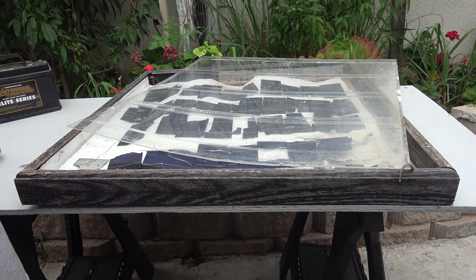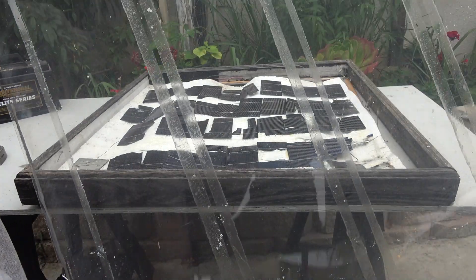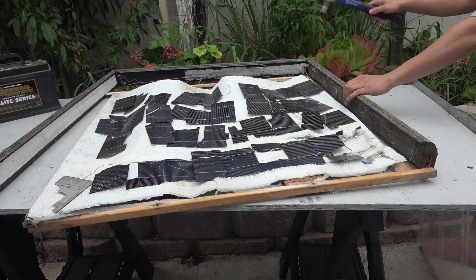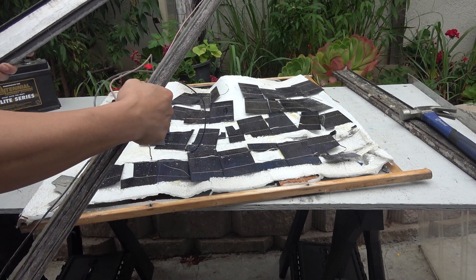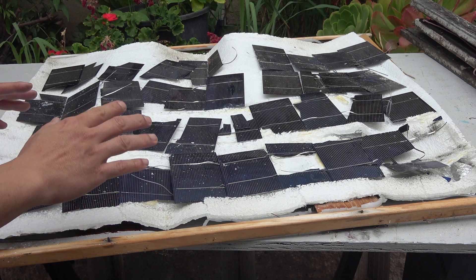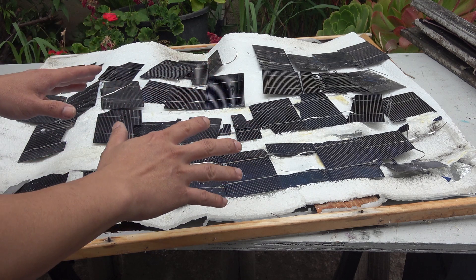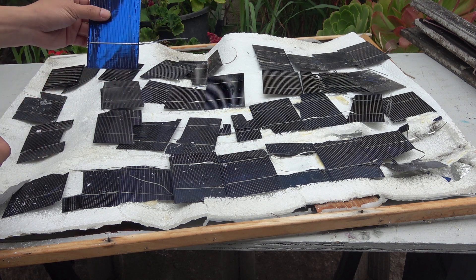It's time to say goodbye to this 12-year friendship. You can see there are a lot of cracked cells here, but even though they are cracked, they still work as long as the solder connection between cells is continuous — your output will be reduced but they still function. I still have some good cells here; this cell is intact and I can use it for a different project. A cracked cell I can also use for other projects.